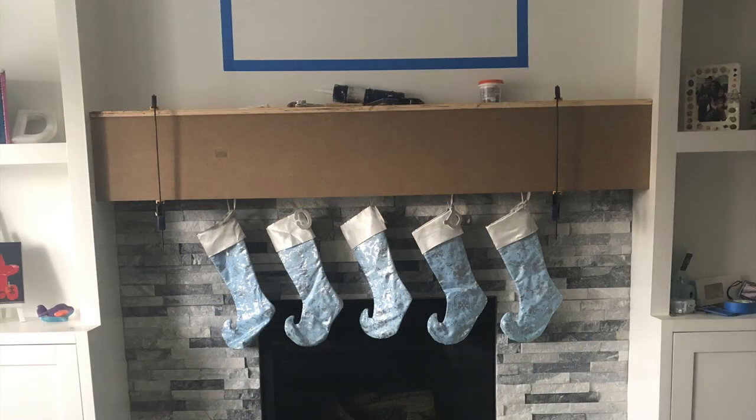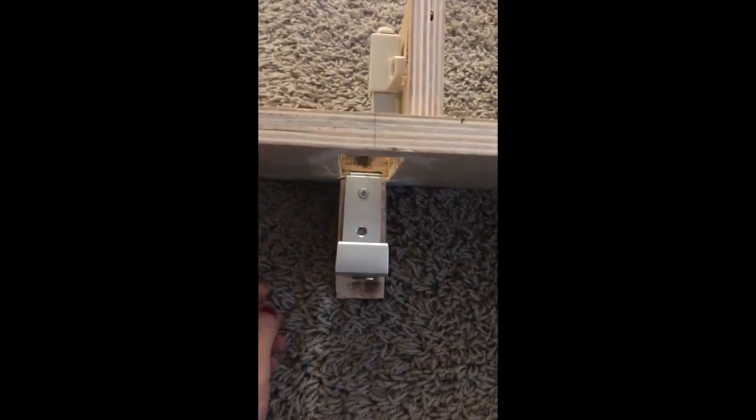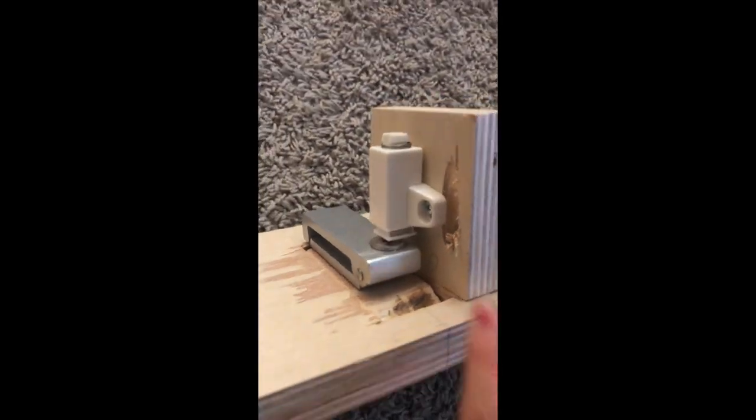So that's why you can see an extra row of stone peeking through the mantle frame. In this shot, you can quickly see how I rigged up the mechanisms for the drop-down hooks. There's a lot of dry fitting here because once the mantle was actually assembled, there'd be no going back to adjust the hooks without dismantling the entire mantle.